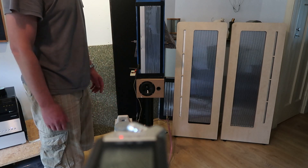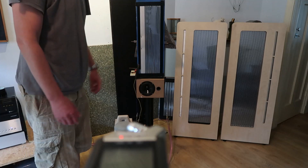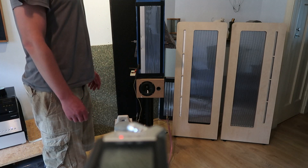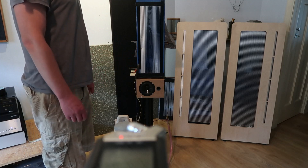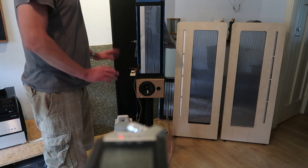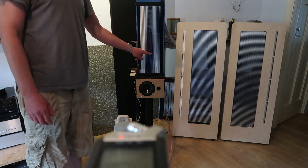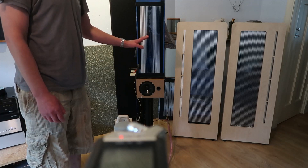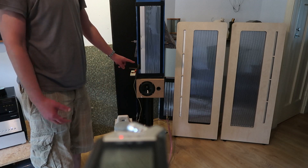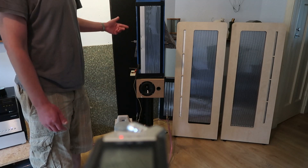It's not completely flat, because then I'd have to use a filter, which is possible, but then it becomes a three-way or four-way, which I'd rather not do. Or I just use one cap and let it play along — I think this will work. Damping on the mid-range on the inside helps a lot; I didn't do it, but I should have. Damping in the tweeter area might need thicker felt — there's room enough instead of just strapping felt on the back as I did right now.